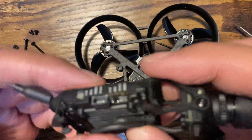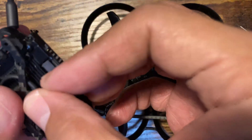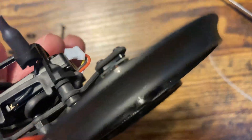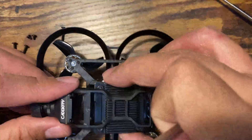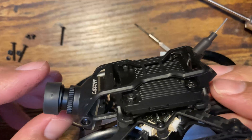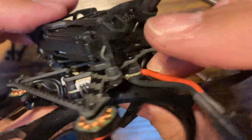This is super important: do not sandwich the MIPI cable between the carbon fiber piece and the VTX. The VTX gets so hot it can melt the MIPI cable's protective covering, and it might even catch fire. This was our big mistake — we sandwiched the MIPI cable between the carbon fiber piece and the VTX. In our final build, we routed the MIPI cable behind the carbon fiber piece so it won't get sandwiched and burned.